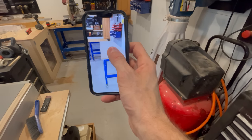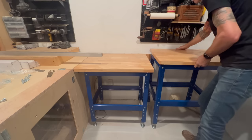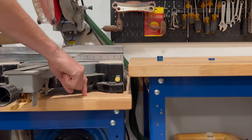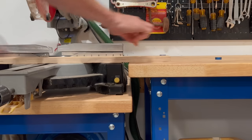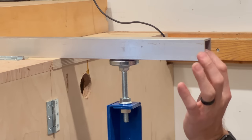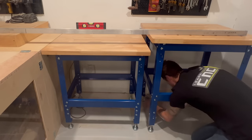For this space, I went with three workbenches: two 24x32 inch for the miter saw station, and one 24x60 inch for the adjacent wall. I'm using two because I need them to be different heights — the saw sits on one, and the other needs to be level with the cutting plane of the saw. It was pretty easy to dial in the height with the adjustable feet. I used some scrap pieces of aluminum to make sure everything was flush from one side to the other, then made minor adjustments once the benches were in place.